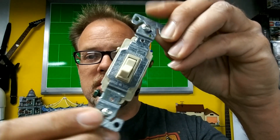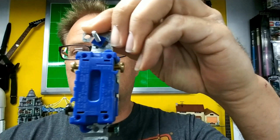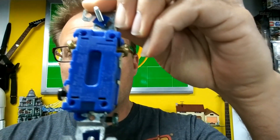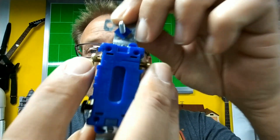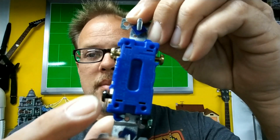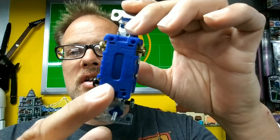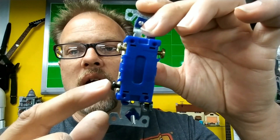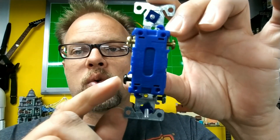Now let's show you what a three-way switch looks like. Here is the switch, and if you look at the back of it, you actually have three points of attachment. How that works is this should be your power in or your power out, which I'm going to show you when we start wiring it up. And then these are your two switched legs. You have the two top and the one bottom. Every time you flip the switch, it'll switch the power to the opposite leg — right now it'll be going from here to here, and if I flip the switch the other way, the power will be going from here to here.